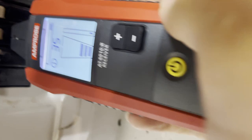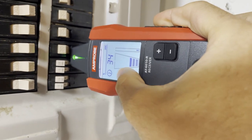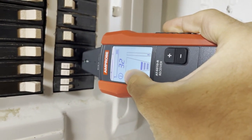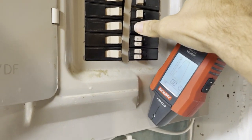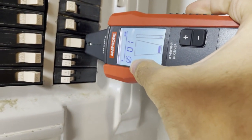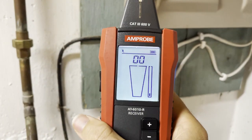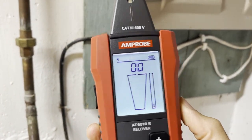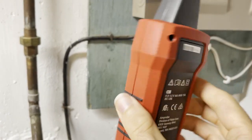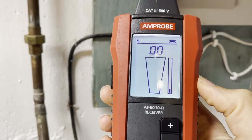Taking a closer look, you can see the energized symbol — that means we're transmitting on an energized circuit. I flip that breaker, and now it's transmitting a de-energized signal. It's still transmitting upstairs, so I know for sure I got it when I flipped that breaker. That's how you use the AT6010. I don't like it quite as much as the 6030 or 6040, but it'll definitely get the job done for less than half the price of those models.